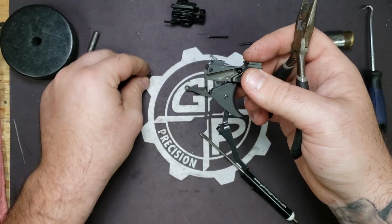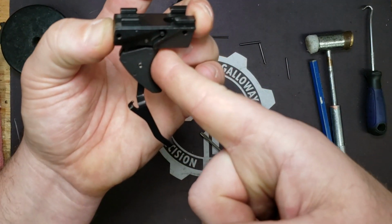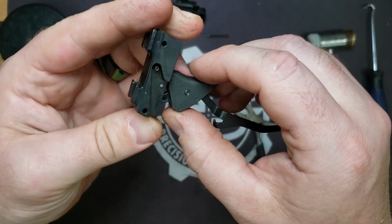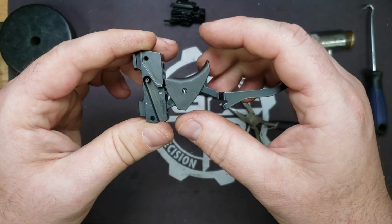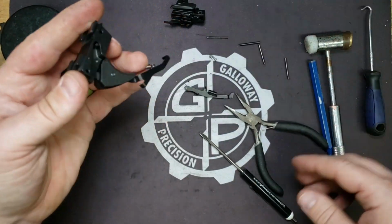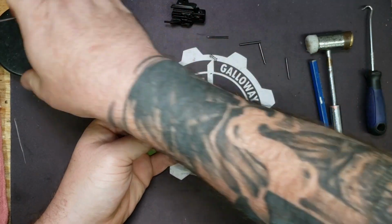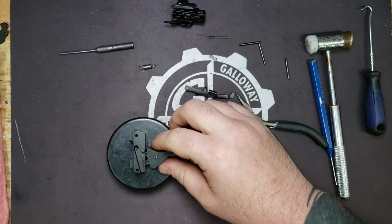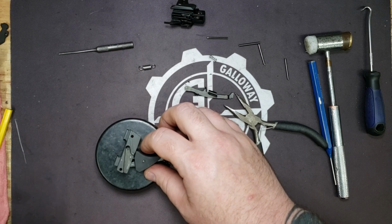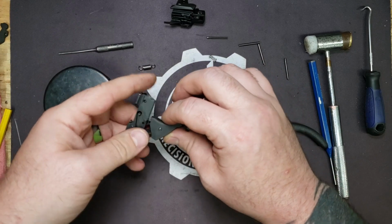Alright, so the way that they have done this design, if you do not grab the trigger properly, if you try and hold it way up high, if you go to the middle instead of down low where it's supposed to, the way the trigger cams, notice it's moving. If it doesn't cam properly, there's a cutout, and once we take the trigger completely out, we'll show you. There is a, this pin is swedged in, and you'll need your 1/16 or 2mm. And my true 1/16 has wandered off, so for now we'll just push it out with an 050 and we'll just take the whole thing out.